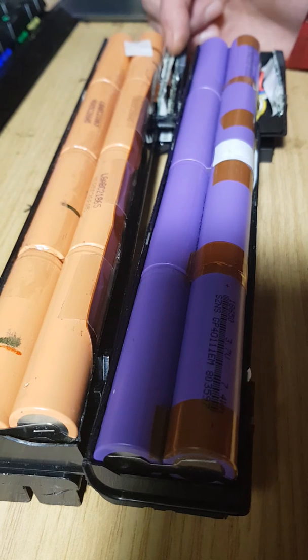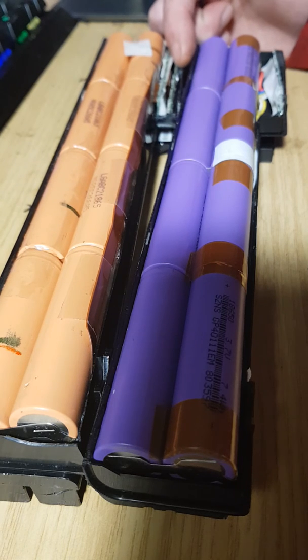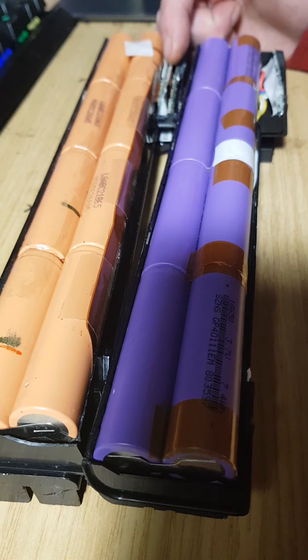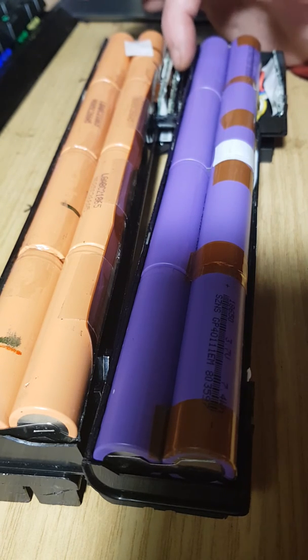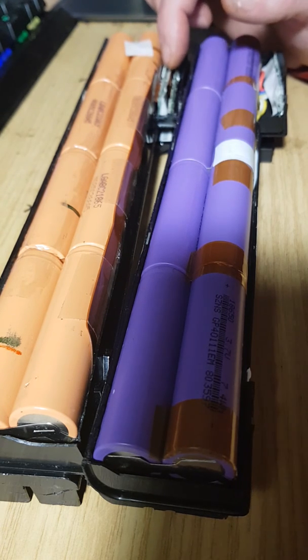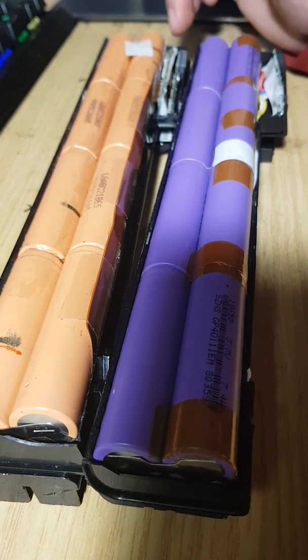And they have got 2 PCB boards in here. One is your board, which most likely contains the firmware and the voltage regulator, and the second board, which I believe would probably be dedicated to the cell protection, cell management, thermal protection, and so forth. The reason I say that is because that is the board that the thermistor is connected to, as well as all the cells go directly into, which then comes off and goes into the smart battery PCB board at the front there. I believe this one here would have all your fuses and fuse links and the rest of it, which would cause disconnection in the event of any kind of problem.